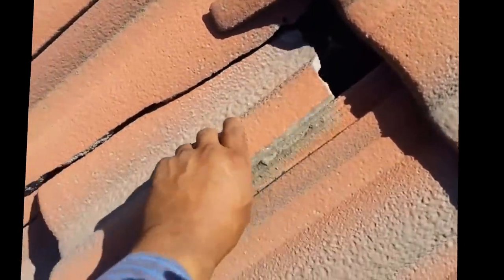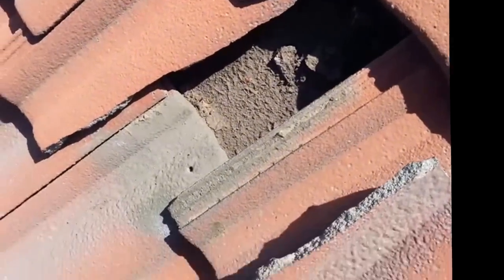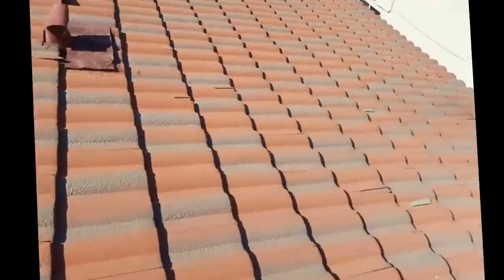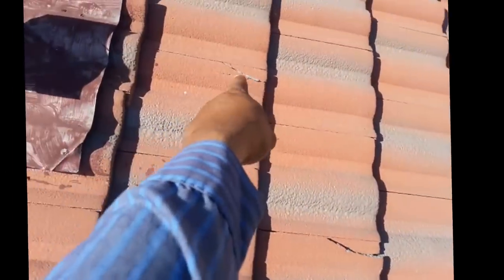Right here I can see the wood, that means the water has been running on top of the wood underneath, and it's going all the way somewhere here in this part of the house. This tile has been broken here for a long time. People just come up here on the roof and they don't know how to walk on it. You have tiles broken all over — right here they're chipped, this one is broken, they sealed it with silicone, this one is broken.